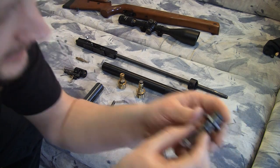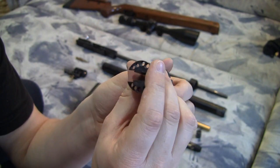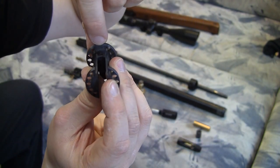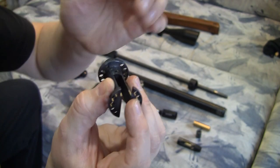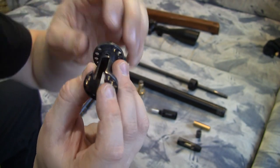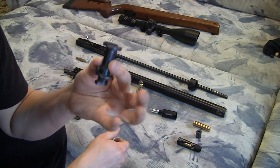And you can also notice that this part was brass before and now it's plastic, so I really took everything off that I could. I didn't drill a hole over here, and I don't recommend you do that, because over here the hammer hits the anti-bouncing rod, so if I put a hole in there, it might break off. So this is the most important part.